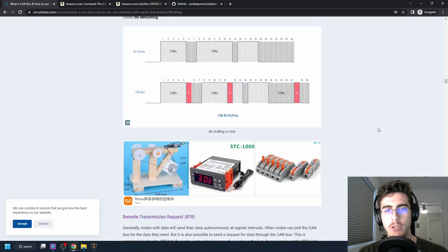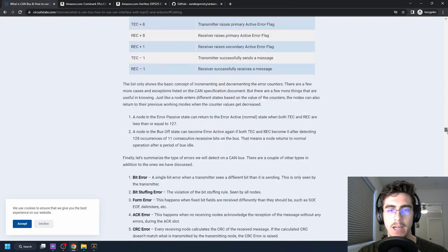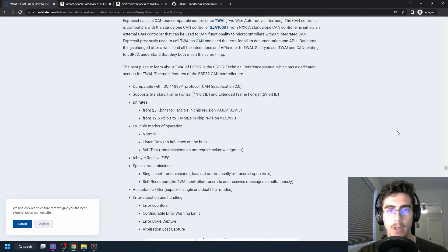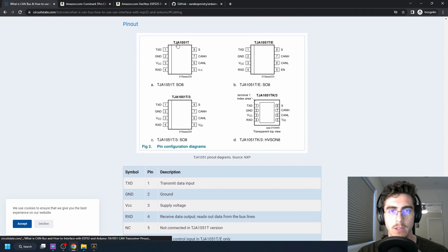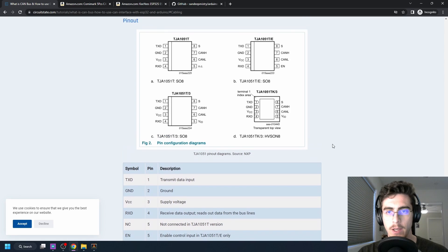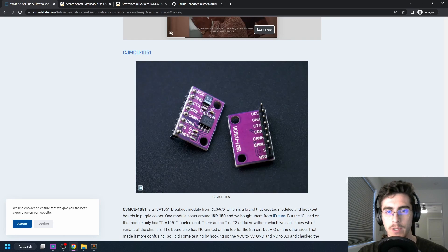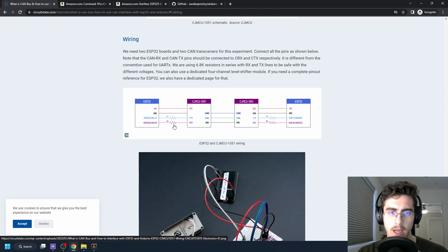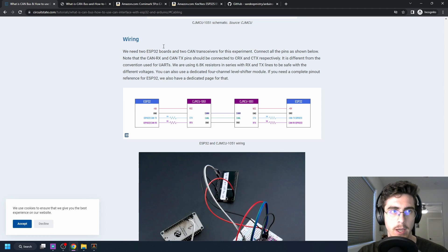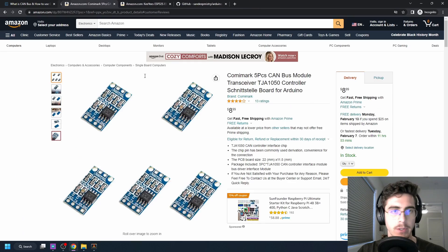They used a different CAN transceiver from the one I have, which is the only novelty I had to deal with — although it wasn't too hard to figure out. They're using a CAN transceiver based on the TJA-1051T, however I bought a different one. So some advice wasn't directly applicable. For example, they connected 10K resistors between the transceiver and the ESP32, but that didn't work with mine. It's a good reference, but you can't copy it directly.